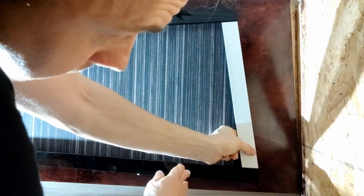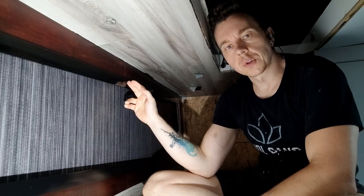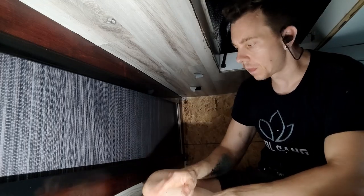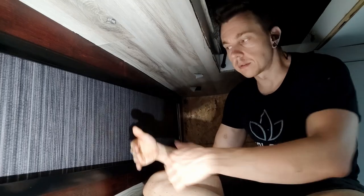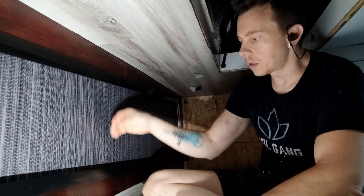Side. I can paint it later. This PVC trim that we put on here serves two purposes. Number one, it's going to clean up that edge, make it look nice and uniform all the way across and straight. The wood wasn't actually straight, especially after I trimmed it with the jigsaw and then put it in two pieces. Second thing is that it's going to reinforce this inner edge of that wood.